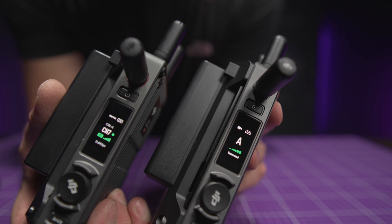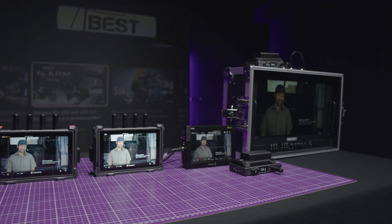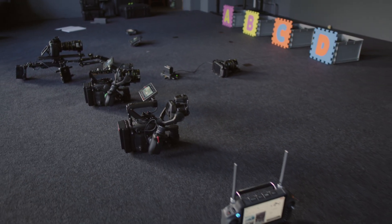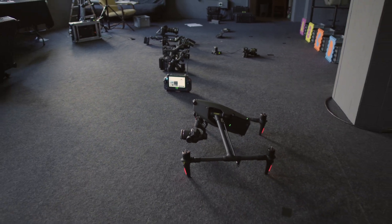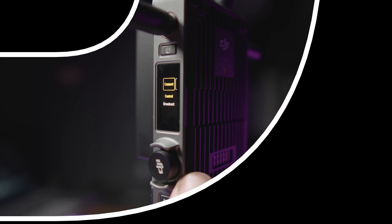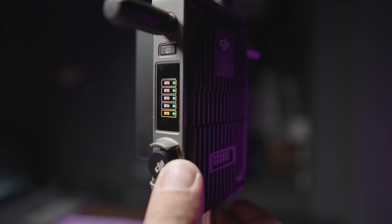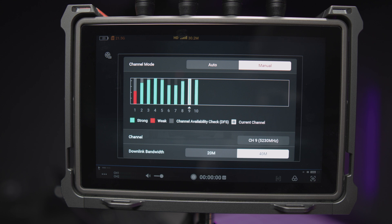Tips: In control mode the signal strength is stronger than in broadcast mode, so the only interference I've experienced is when the receiver is too close to the transmitter — both devices should be more than a meter apart. Do the same when using several transmitters in the same place at the same time. If the automatic frequency search mode is affected by interference, you can always switch to manual frequency selection. In the receiver, select the channel defined by the green dot — and it's even easier with a hybrid monitor because there you have a simple graphic with red and green bars suggesting the best channel.